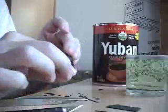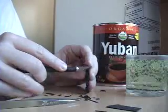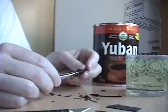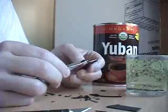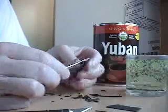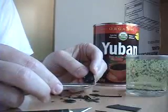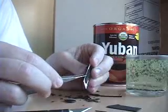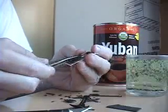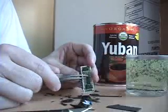So this one had a little bubbling, and you can see it bubbled where it shouldn't have. I'm going to take off the edges — this one's very loose. And you can see this just really wants to come off after soaking in the acetone; it really just reduces its connection. Here we can see this is coming off quite a bit, still some residual, but pretty well coming off this one. So far it's been my experience that the acetone doesn't seem to damage the components or the hybrid traces, although there is some residue left.